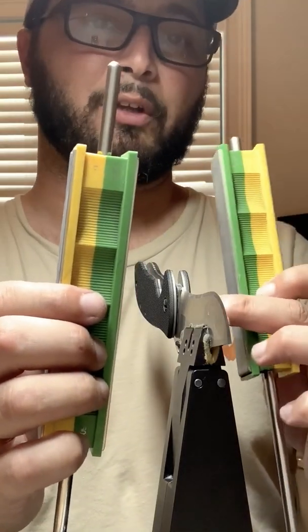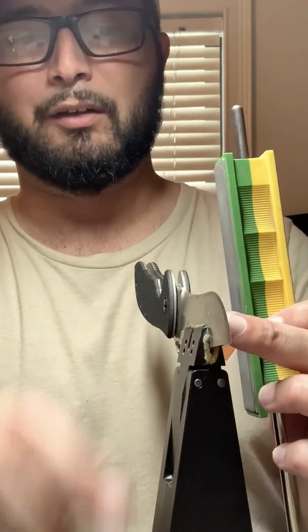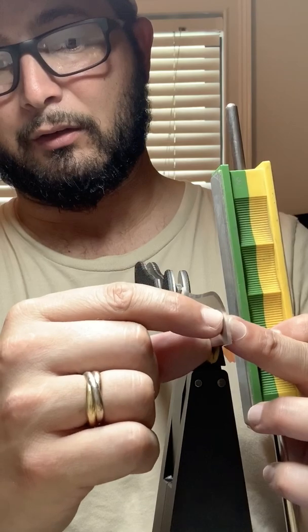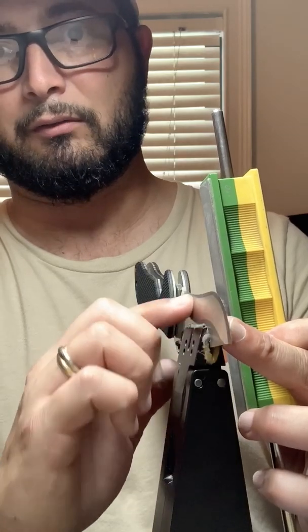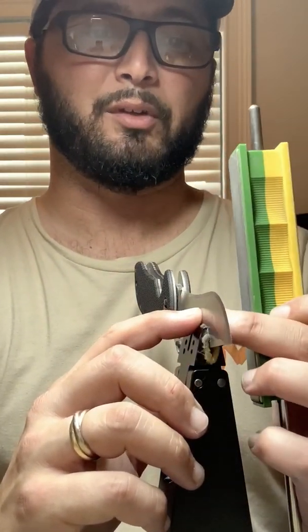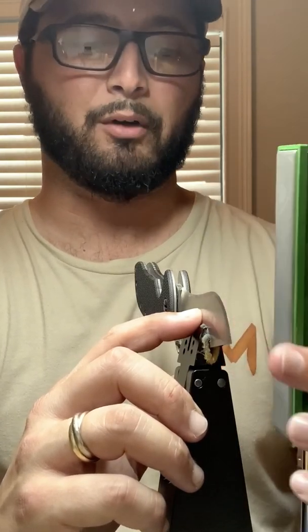So although I'm only cleaning the burr on this backside, I'm gonna polish that backside just like I polished this side. Obviously, this dimension from edge to the cut, which is hard to see right now, will be a much bigger bevel because it's intended to be. This backside will be tiny. You won't be able to see the polish as much, but all we did is clean up the burr on that side.